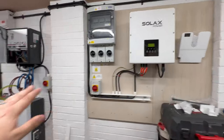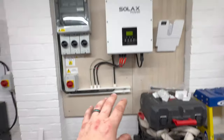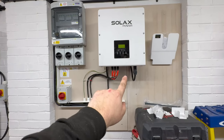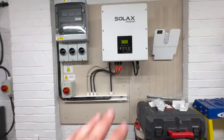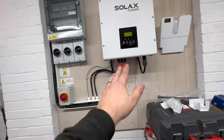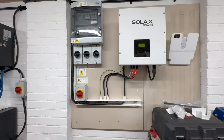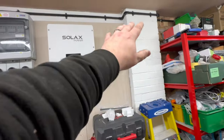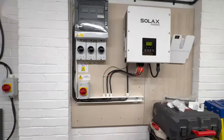Over on this side we've got our board. I've shuffled things around a bit because of the space provided by the client. There is a possibility of more AIOs in the future, which is why we've left this space free. Here you can see we've got our Solax inverter, all wired up with the three strings. Two of them share 24 amps and the other is a 12 or 13 amp MPPT. We've popped the wires in to one side while they're coming directly underneath — if there are AIOs stacked under here in future, there's a bit more cable to play with.